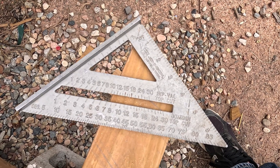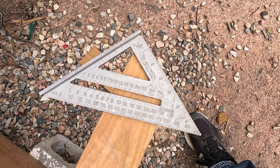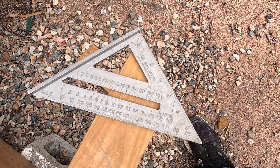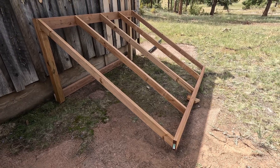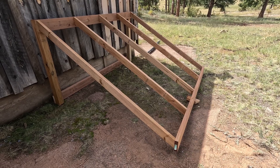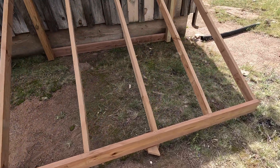I'm cutting my angles at 31 degrees — you can see it right here. At my location, 31 degrees is the optimum all-year angle for solar panels. I'm not building something adjustable, so it'll just sit and be efficient all year round. Here's what I have for the solar ground mount so far — this isn't its final location, I just built it here using the cabin wall for support since I'm working by myself. It can fit eight 100-watt Renogy panels.